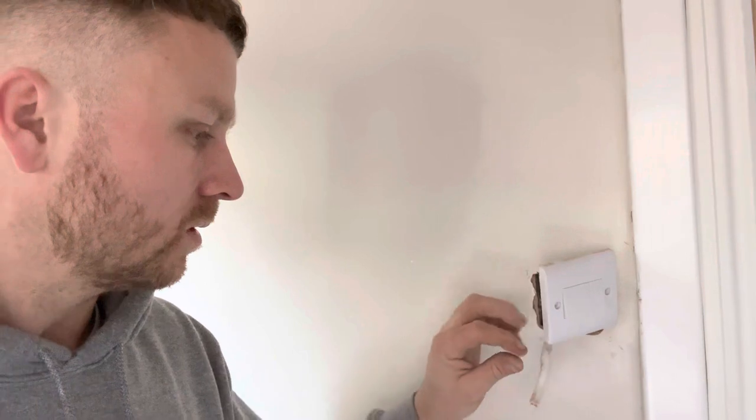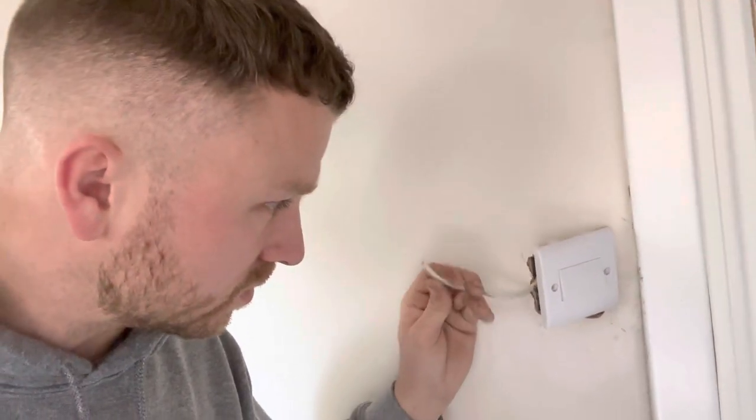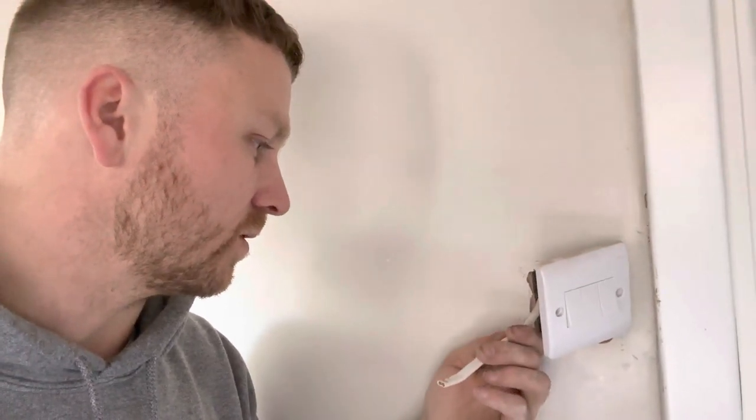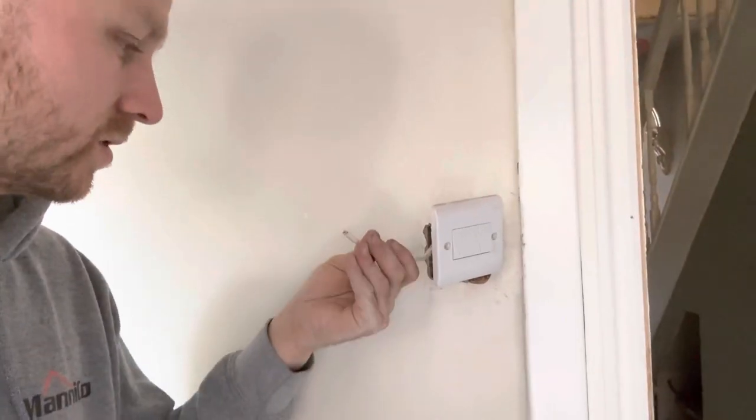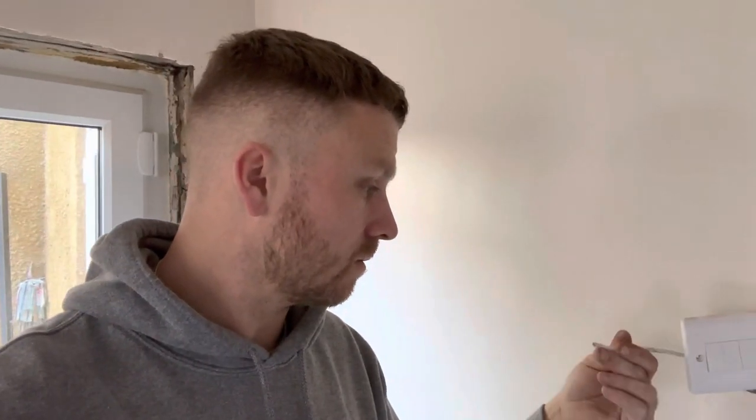So I've isolated the lighting circuit and basically gone hunting for that cable. There was no need to look up in the ceilings because after a bit of investigation everything in here looks to be mains at the switch, which is handy. Thankfully the last electrician has left the cable accessible. Not quite sure why this fire-rated twin and earth cable has been used here when normal grey twin and earth has been used for the rest of the property. I don't know if it was just what they had left. Whatever, it's not a problem. We'll connect this one into the main side and then put a pull switch and a spotlight in the downstairs toilet.